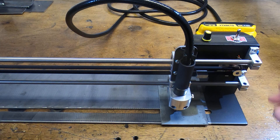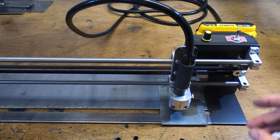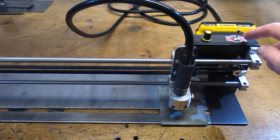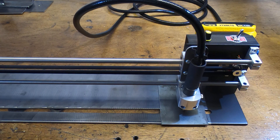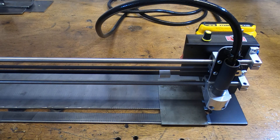We'll try a dry run — I haven't got the plasma cutter connected at the moment, but the proper end stop micro switches are now fitted. Putting it into return-to-home mode, it should drive back to the start and stop without crashing into the mechanical end stop. It drives back at full speed regardless of the speed pot setting and has successfully driven back to the home position and stopped. No relay click, which is correct — the plasma cutter should not be on when returning.